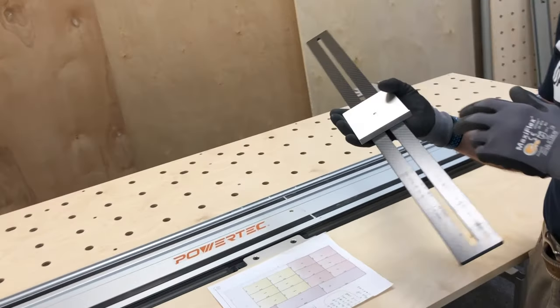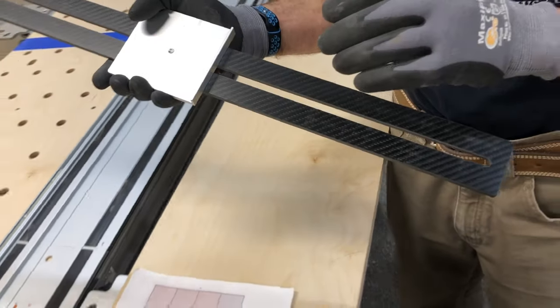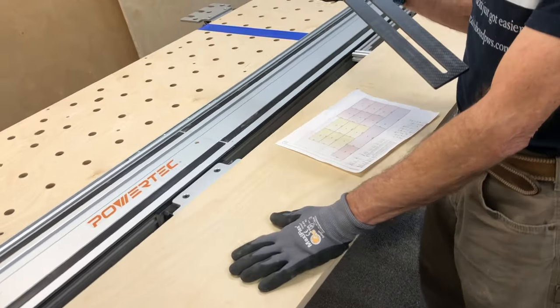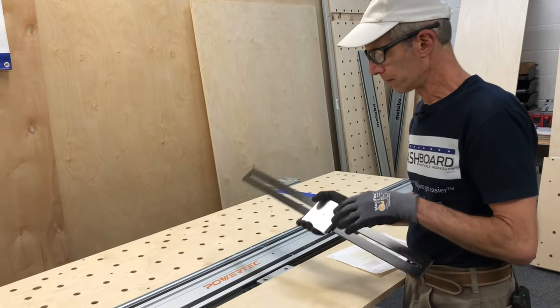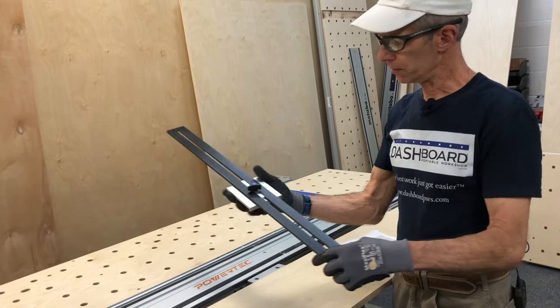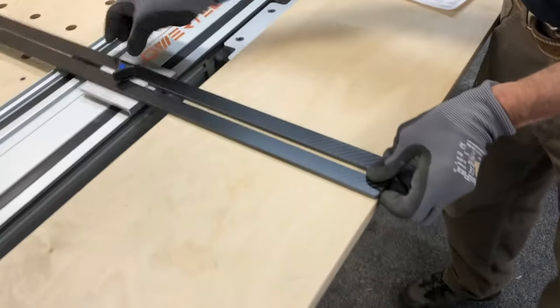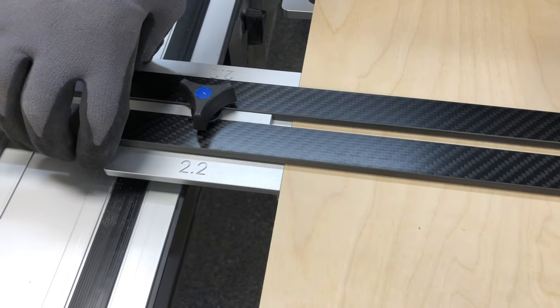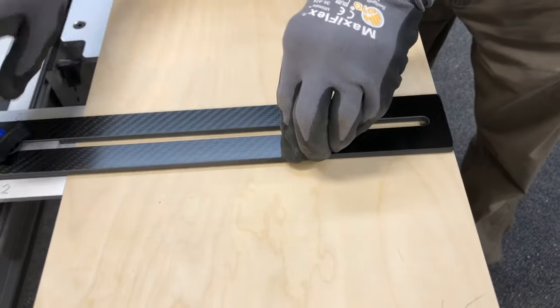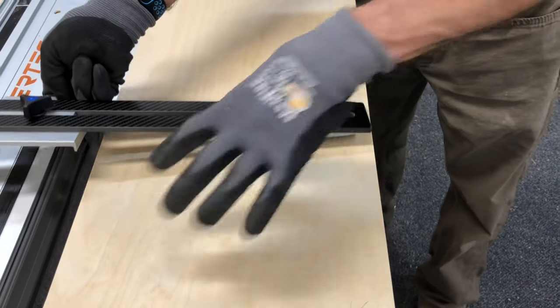This is where the tab really comes into play — it represents the blade when we set the dimension of the cut. I already ripped the same width piece off another sheet, so I just want to duplicate it. To duplicate it with the rip gauge, set the extension flush with one side of the piece you already have, hold it there, pull the plate over until it contacts the other side, make sure you're square, and tighten the knob. Now this is the dimension you will cut — the blade is right here, so this is what will be left.